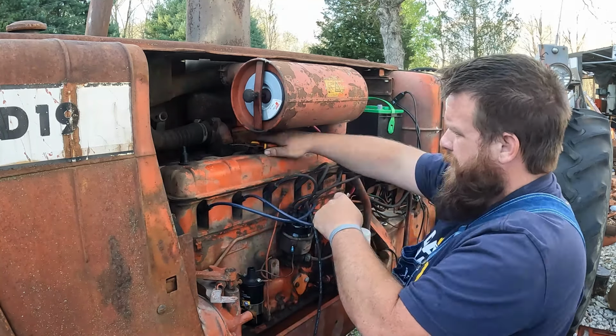Alright. Guys, I thought you guys were recording and you weren't, but you didn't miss nothing. But I got all six wires here changed out. New coil wire. New coil. Let's jump on the other side and we'll put that starter on and see what we have.